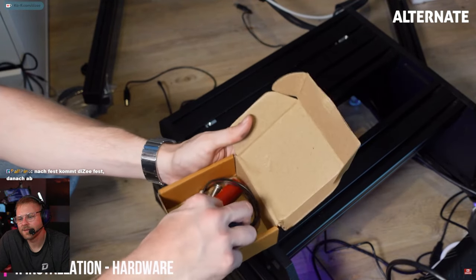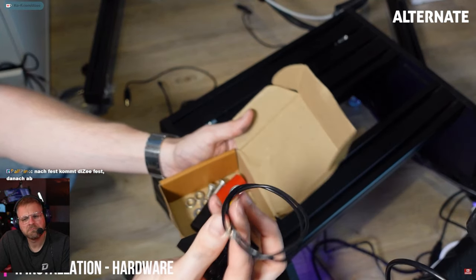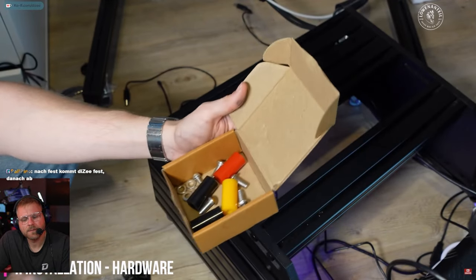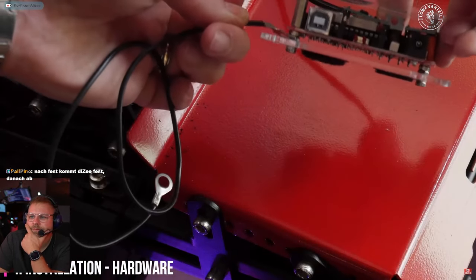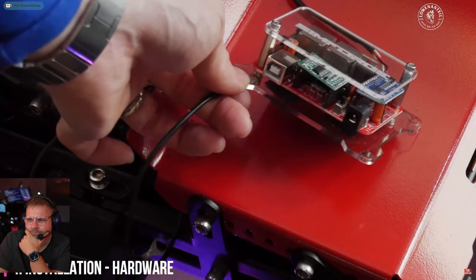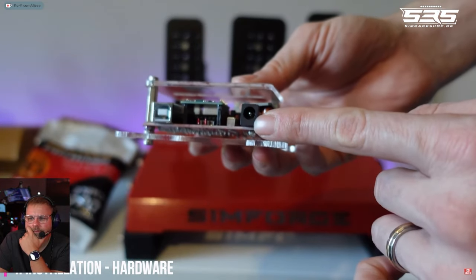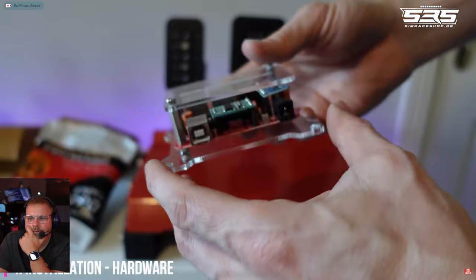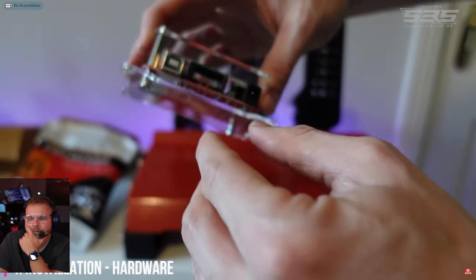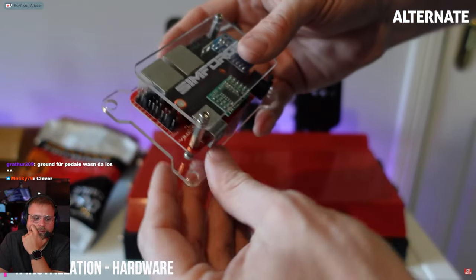You may need to ground the circuit board. When I initially received the pedals, I was seeing a lot of fluctuation in pedal inputs from the brake, which is extra sensitive due to its 24-bit sensor. With lots of back and forth chats with SimForge, they changed their design and the latest circuit board works a treat with no interference whatsoever. If you do see pedal input fluctuations, I'd highly recommend getting a dedicated power supply. It's a shame that power supplies aren't provided with this set, as it would make the interference a non-issue. You see, the circuit board relies on USB power to function.